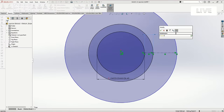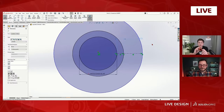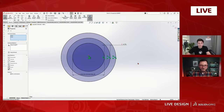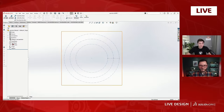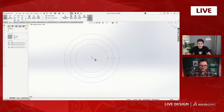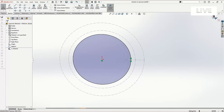For my coil I decided to do two different helixes — two different coils — so that the fluid can flow up the vaporizer and then back down to the flow regulator. I'll make both of these construction lines equal. This will be a nice general reference with my variables in it that I can use for my helix features. Now going into the helix feature, all you really need to do is draw a circle at the center of the helix. I'll draw a circle right about there, make the center coincident to the midpoint of that line, hit OK, and now we have our helix.